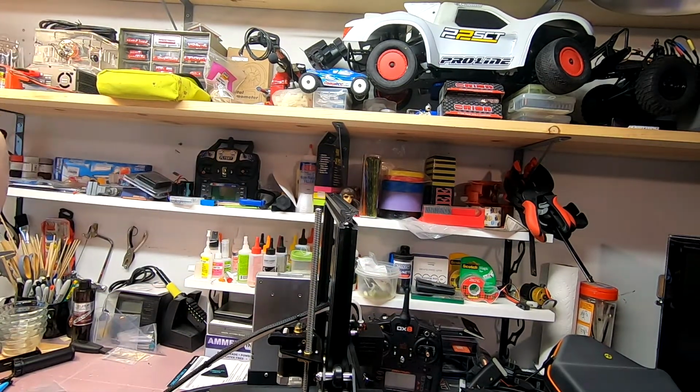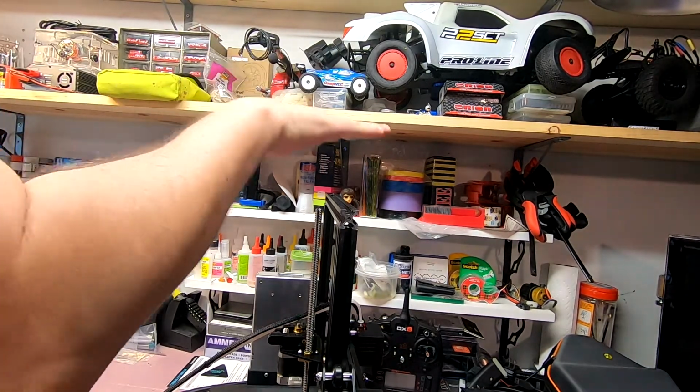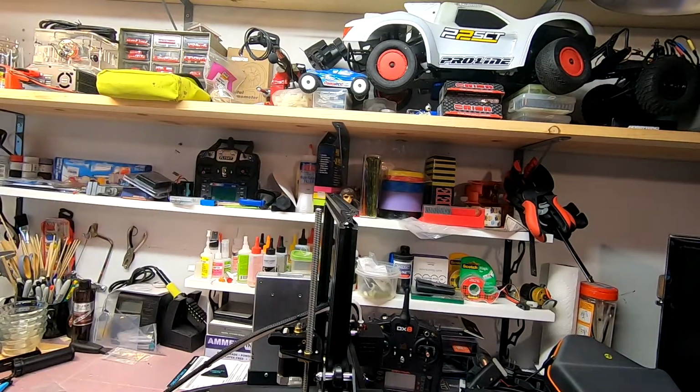And before I go ahead and mount this firmly, I'm going to put the bracket that is going to hold the roll of filament in place. And that is going to require two 5x8s and two of these slide nuts, or T-nuts as they call them here. I've seen them called slide nuts. Let me just confirm I've got the right piece of hardware there. It's the only thing left, so it must be.